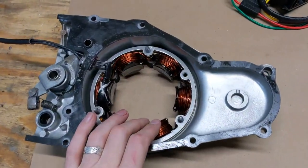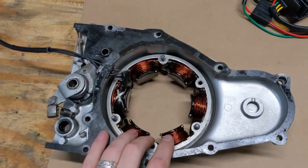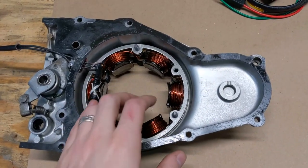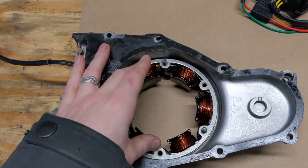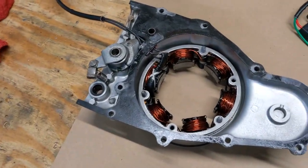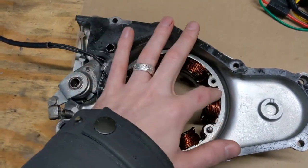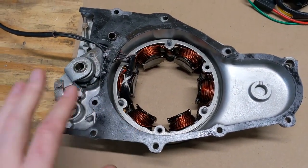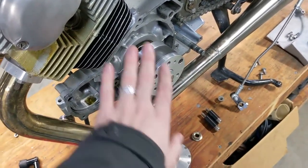As you can see here, I already have the stator installed in the case. Like I said, it is for a CB350, so I had to make a few changes, but nothing drastic. The main one being the CL175 stator holes are tapped, whereas this stator meant for the CB350 they're just through holes. So I ended up having this locking ring made, which has a bunch of tapped holes in the pattern to hold it in. I had to cut down a couple tabs — just minor stuff — and it bolted right in. And the rotor, thankfully, is the same exact taper between the two bikes, so that just bolted on.